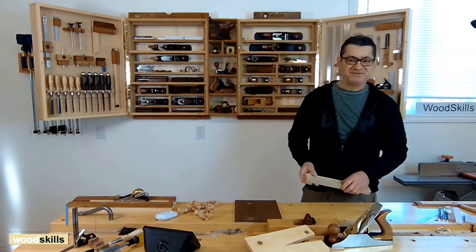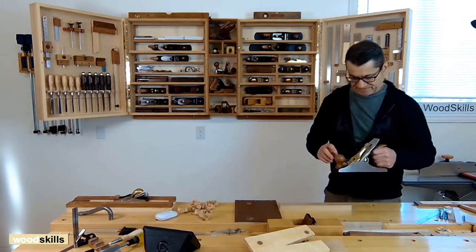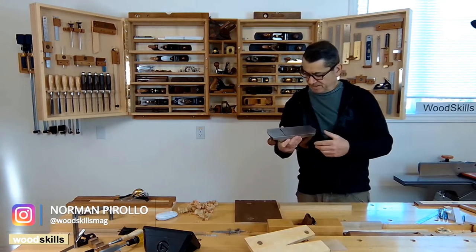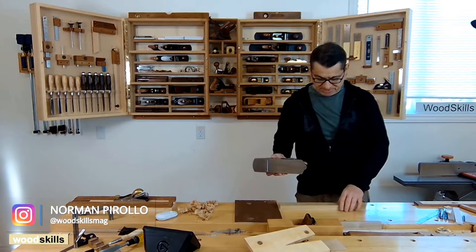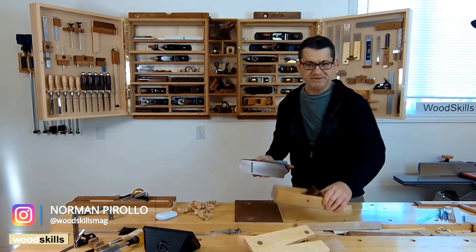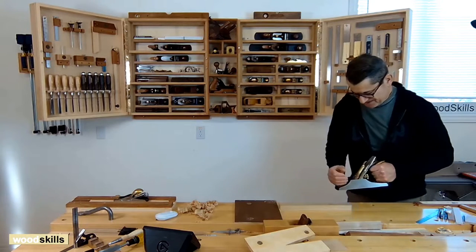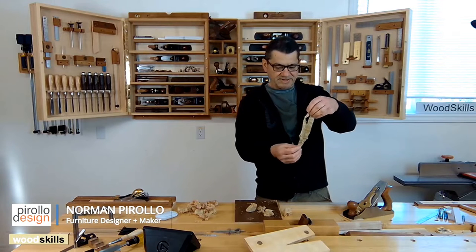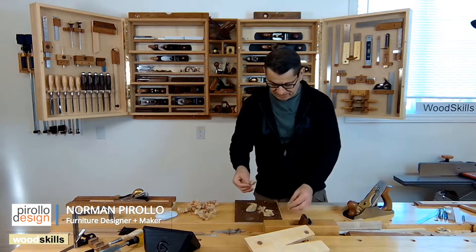it. I'll just demonstrate this, with both a 4.5 bench plane smoother that I normally work with, and I've just honed the blade on this, and then I'll demonstrate it using a wooden half plane that I've created several years ago, more than several years ago. So, wispy thin now. It's almost like a linen, and that's what I'm striving for.